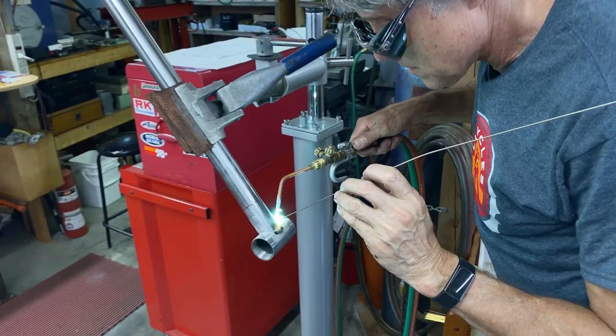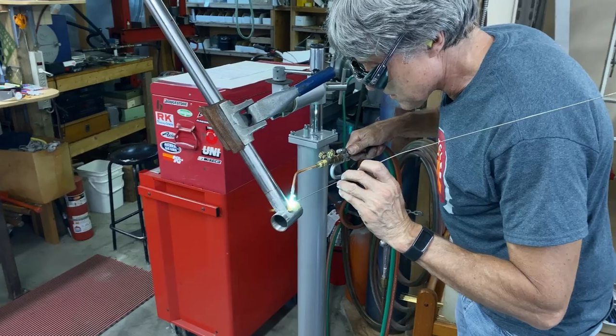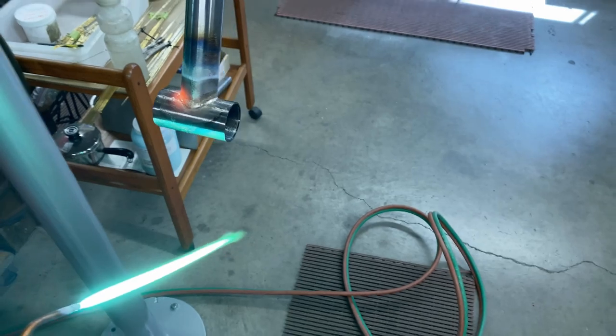So we've got a little tack there — that's the first step of building a frame. I flip it around and do the same thing on the other side. The bottom bracket took a little longer that time — put more heat on the bottom bracket, it's a little thicker. I've got the torch maybe half an inch — maybe 12 millimeters — away, aiming the heat a little more at the bottom bracket because it's easy to overheat the tube. There you go, we'll just let that cool down.